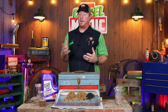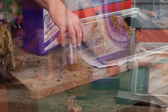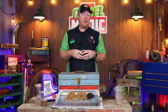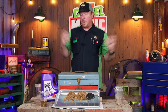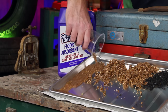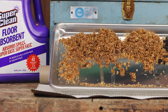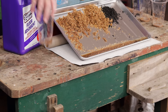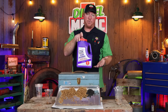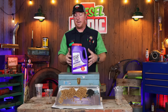It's been 10 minutes and the three-to-one is still kind of runny. Dumping it out — it's quite a bit runny, but it actually looks better than the one-to-one oil dry mixture we did. It's not a whole lot of difference, but it's definitely safe to say that the Super Clean outperformed the traditional oil dry, safety absorbent, old-school clay-type floor dry absorbent.